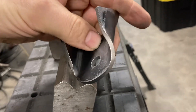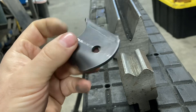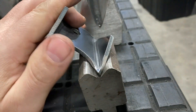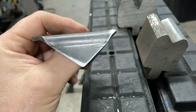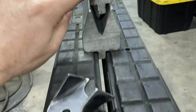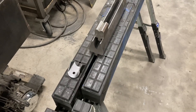With the shorter die, that unsupported distance is just so much shorter. When I first designed the part with the slots, I didn't intend to bend it with this narrow die because I didn't think it would do a nice job, but it actually did. You can get away with non-optimal widths on the die — it's kind of a case-by-case thing, you just got to experiment. Being that this part is so short, the extra tonnage it takes is nothing to worry about. So if you have different dies to play with, you can get different results. And if you don't have a narrow die, then doing things like the slots comes in handy. So that's it — hopefully this was helpful. Thanks for watching.